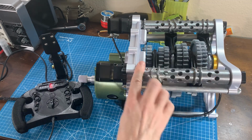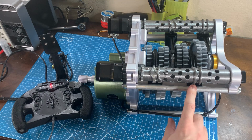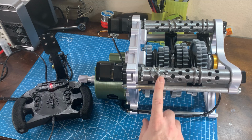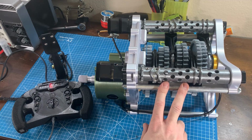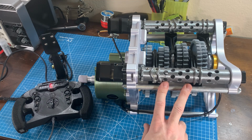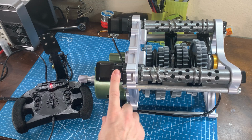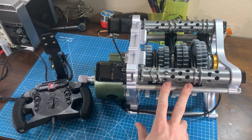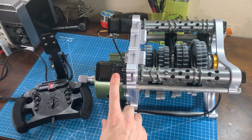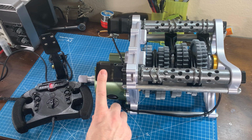The shift barrels actually have more than enough torque now. It can actually bend the shift fork tube during a missed shift. Realistically, that extra power wasn't needed after the power supply issue was fixed with the battery. So I may mess with taking those off and see if I can get the shifts to be even faster. Right now, they're about 7/100ths of a second. But I know prior to the planetary gearboxes, I was getting them down around 5/100ths of a second.